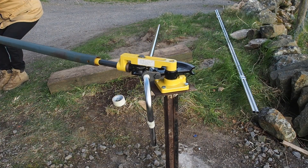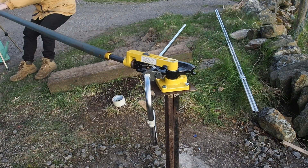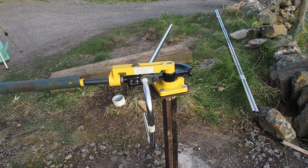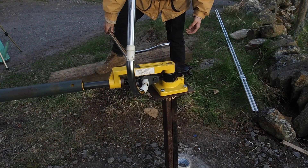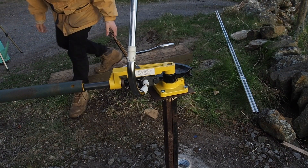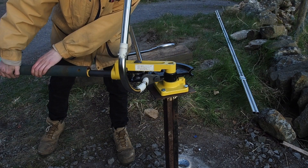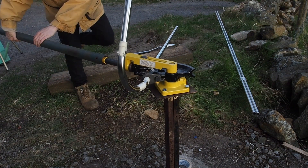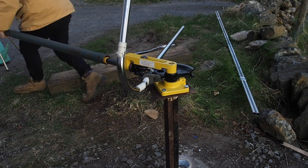The bend forming now is where the forks will attach to the frame. Now I've put the frame in the bender vertically so I can bend the top section of the frame to fit around the battery, which will be housed just underneath the seat. This consists of two bends one right after the other to bend the frame out and then back in.